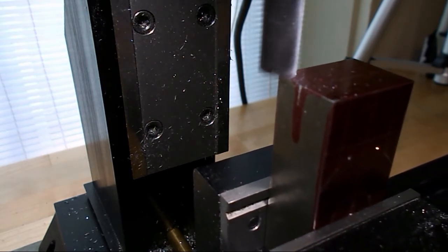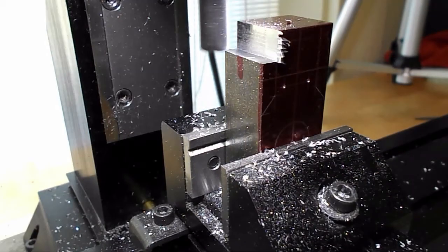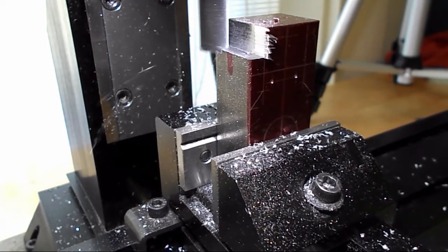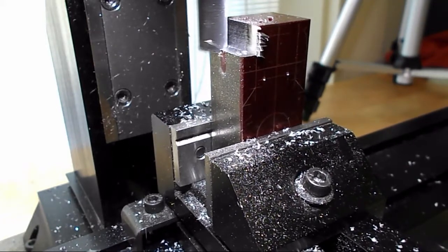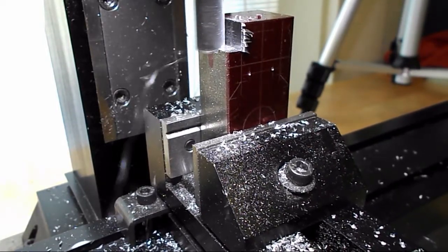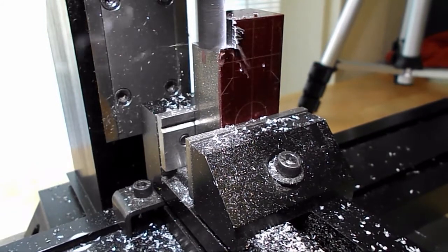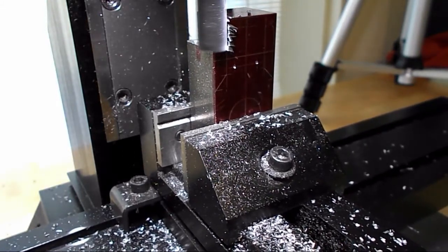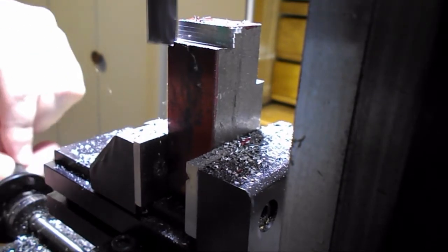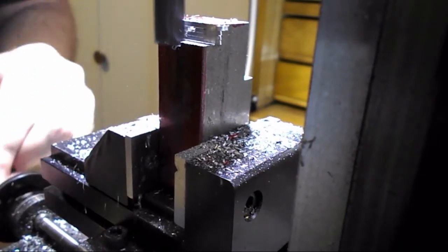The carbide end mill is very accurate. I set it up against the edge, and then I'll use the indicator set on the edge of the table to dial in the location, which here was 187.5. I added some of the audio back in to get an idea of what this machine actually sounds like as it's cutting. This is just a witness cut, so I'm just checking to my scribe line. But here's a more substantial cut. The witness cut was about 50 thousandths of an inch, and here is the other side of the cutout — again about 50 thousandths of an inch.